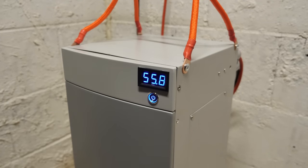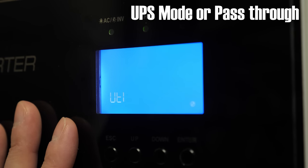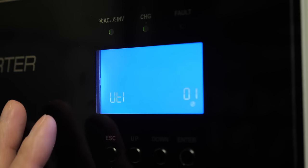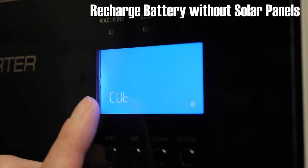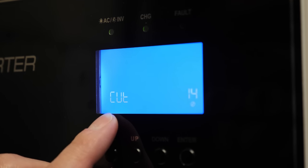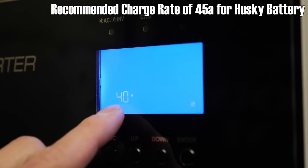The battery is at full charge. On the inverter I've set option one to 'utility first,' so utility powers the loads first, and solar and battery only kick in if utility is not available — a grid-down situation. For the recharge setting, utility charges the battery first, so when grid power comes back the inverter automatically starts recharging. I've set the recharge current to 40 amps.